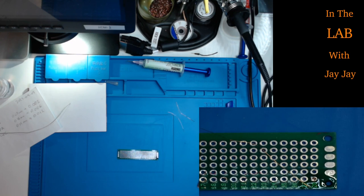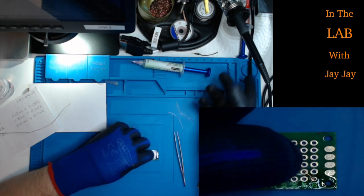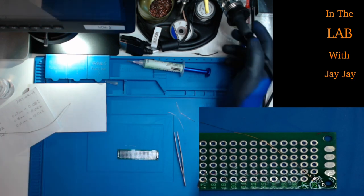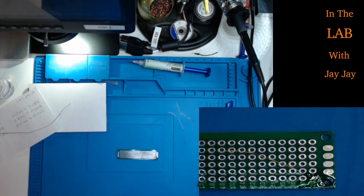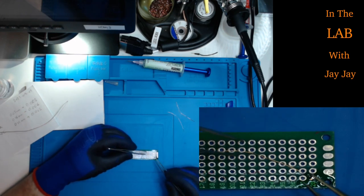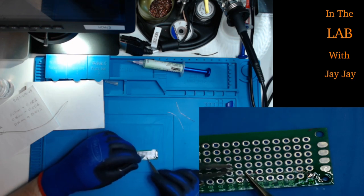So, we're going up to 21B, which is here. So what I'm going to do, and this is the opportunity for me to use both my tweezers at the same time. And can you see 21? Yes, you can. All right. Now what we're going to do is we're going to bend him just there and pull him up this way. There we go. Try and run him along the middle there. And then here, we'll just bend him back over there.